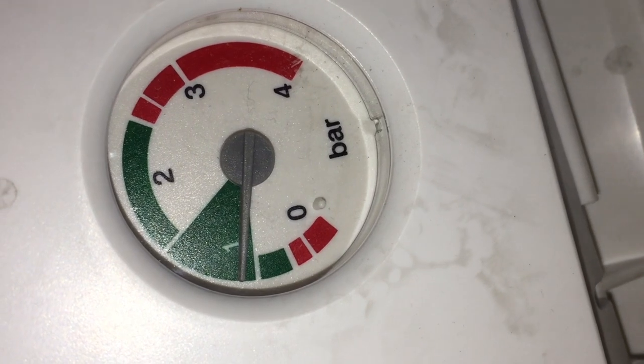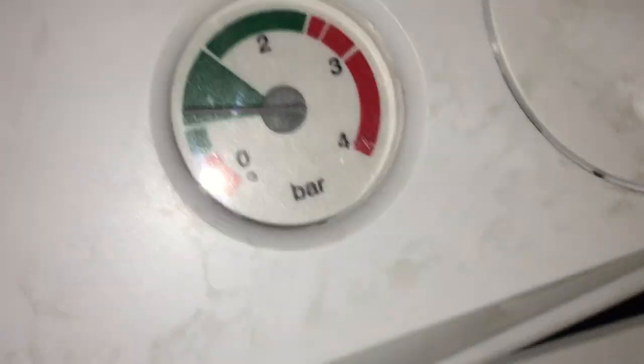I've connected my pump. It was well below one bar and now I'm pumping it up. I would usually set all vessels to three-quarters of a bar, but here I pumped it just above one. As you can see, we've got that needle up into the green.